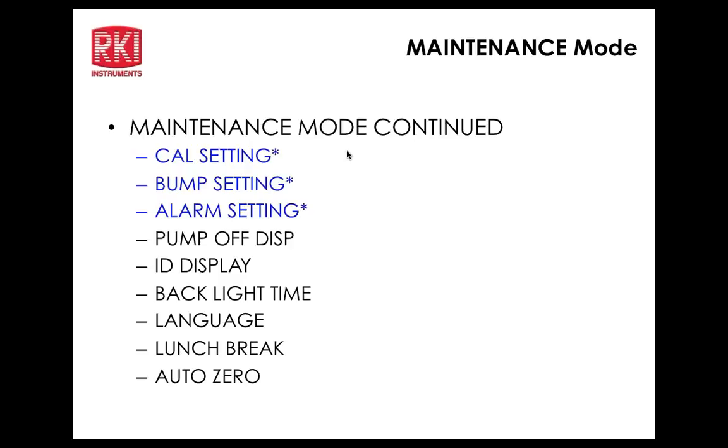And zero suppression, center that. So right now it's 2%. Right now it says 0 for H2S and 2 for the rest of the sensors. So typically 2% zero suppression is the default. What that means is it typically keeps the units reading 0. If there's a little bit of sensor drift occurring that's less than that range, a 2 or 1, it will just be suppressed to read 0. In fixed systems, that applies to the negative range as well. If they read negative, they'll also be suppressed to read 0.